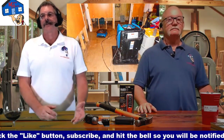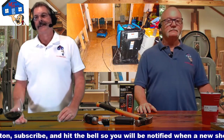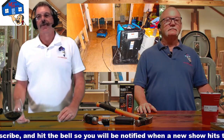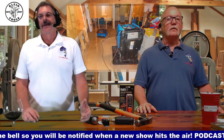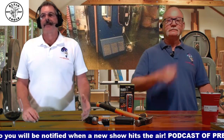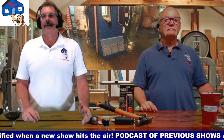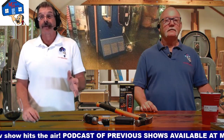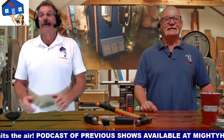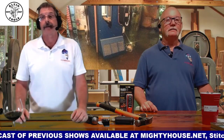If your thermostat's on the first floor, the air conditioning or your heat is demanding, so it's trying to run, and unless it blows the breaker, it's sending electricity to that blower motor. So again, there's another source of potential electrification of your water. That's why you don't walk out there. Make sure you turn your thermostat from heat to cool to off, so that you don't go down there and all of a sudden it demands, and then you get fried. You know what I mean?